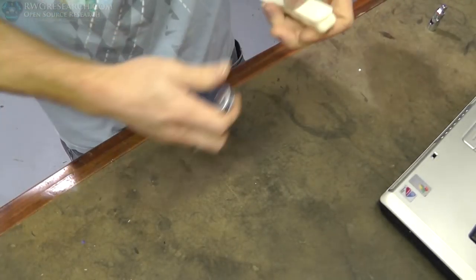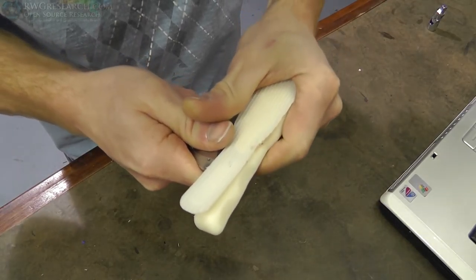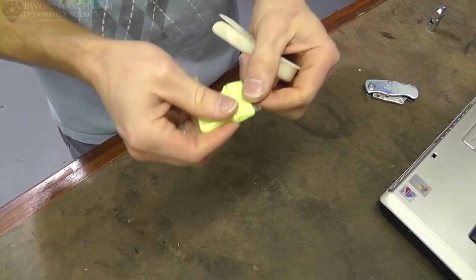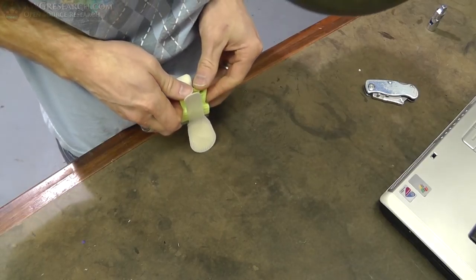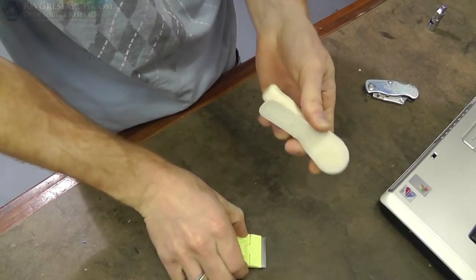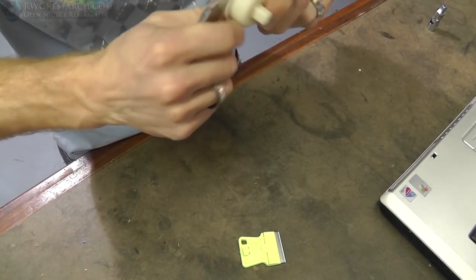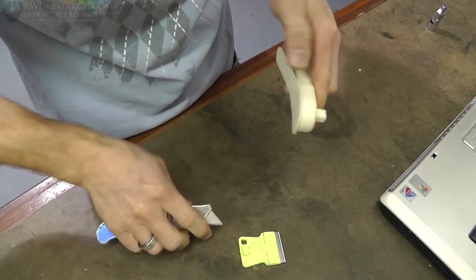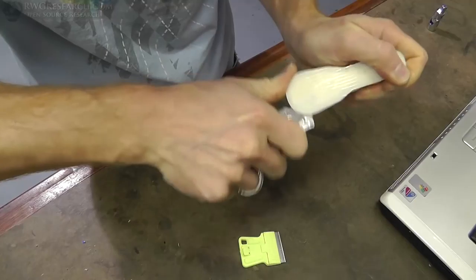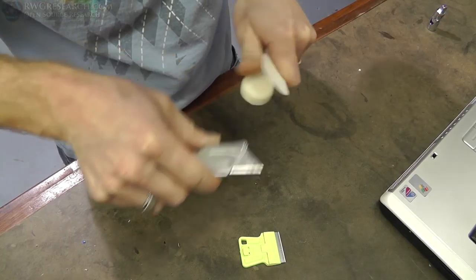My normal settings work pretty good with the raft like this, so let's see if we can get this one off without hurting myself. I like printing on these rafts because if I have any imperfections in my bed, or the goop on my bed, it will not interact with the print, and it just ends up leaving a nice finished result. Depending on your settings, this comes off really easy or really hard. But if you get a knife in between there, you're not actually cutting the plastic — you're just giving it a tiny little spot to pry off.